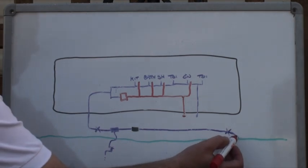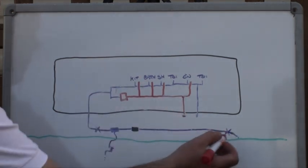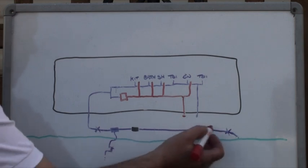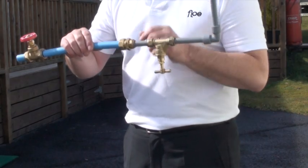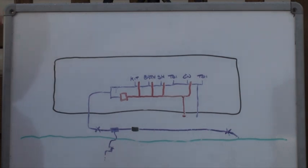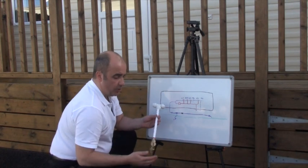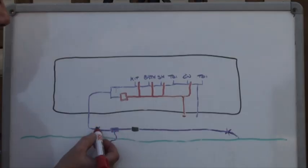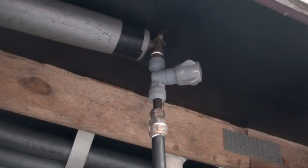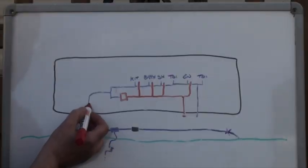As we discussed, the water comes up out of the ground and meets its first stop cock, which allows the property to be disconnected and stops any further water coming out. Then a blue or black alkathene pipe will generally come along the ground until it meets the reducer, which brings the pipework down to a more domestic water pipe size. At around this point you will find that an outside water tap or faucet has been fitted, teed off at this point. Moving forward, you have the stop cock right underneath the property itself, which may be an easier access point to turn off your water.